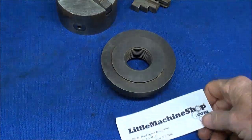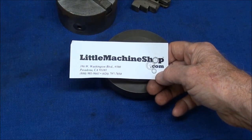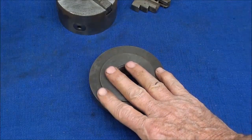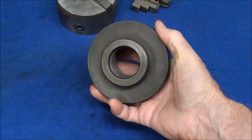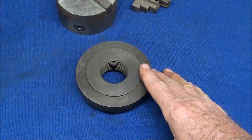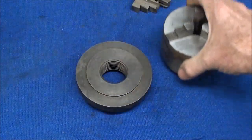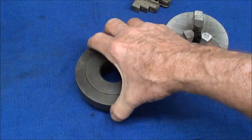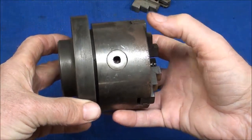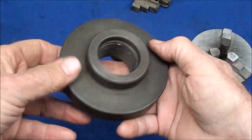I did a little surfing on the internet and I came up with this little machine shop. This is the first thing I bought from them, and I think they're a pretty good outfit. It came real quickly, priority mail. This was twenty bucks, it's got the right size thread — inch and a half — and that fits right onto the Atlas lathe as it is now. But this is four inch and they did not offer a three and a half, so there'll be some machining to do to make it the right diameter. I think I'll thin it down a little bit too — it seems a little chunky and thick. It makes this chuck too long when you combine the back plate, and there'll be this step on here that needs to be machined.